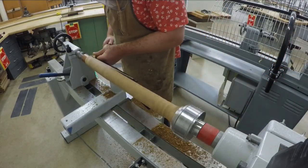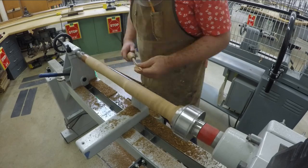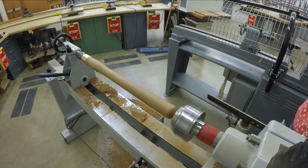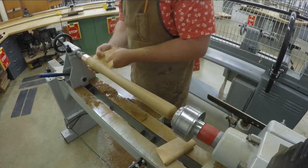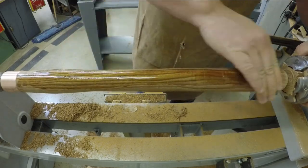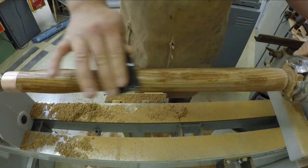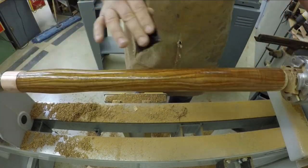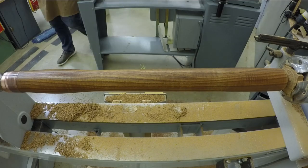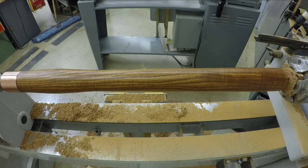It turns really smooth, very easy to carve into, but not too soft. It's very easy to shape and extremely easy to sand to a very nice, smooth shape, curve, and feel. I really did not spend a lot of time sanding this — it sanded up very quickly and nicely, but mostly I got a really smooth cut off of the tool. Here I am applying the first coat of Odie's oil on this tool handle. One thing I noticed is because the thermally modified ash is so dry with no moisture in it, it really soaked up quite a bit more Odie's oil than you normally would for something of this size.